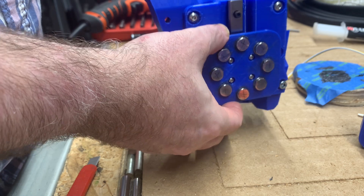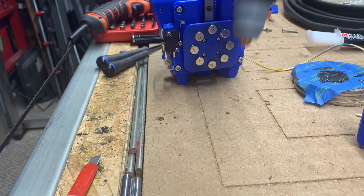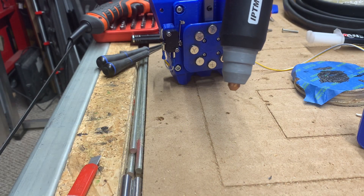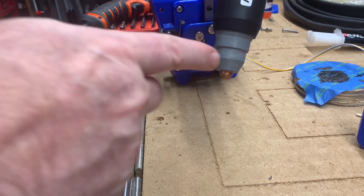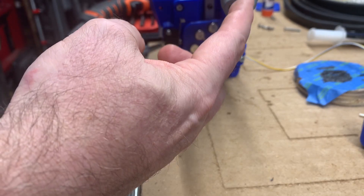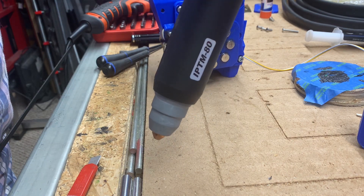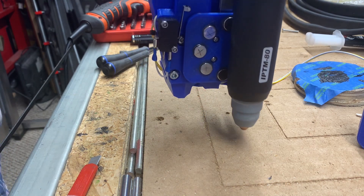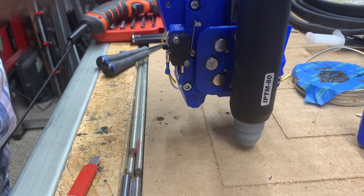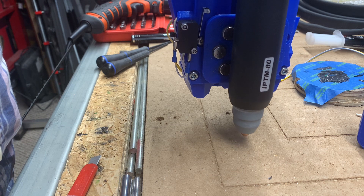There's another important reason besides the automatic torch height control and knowing the correct cutting distance above the metal — and that is that when your torch first fires up the arc to punch a hole through the metal, at that moment you're going to get a lot of splash back from the molten metal. If your torch is down really close when it pierces, your tip is going to get gummed up by a lot of molten metal splashing up. So what most well-designed plasma CNC systems will do is drop down until the floating Z end stop triggers, then pick everything back up to a pierce height, then pierce to punch the hole through the metal.